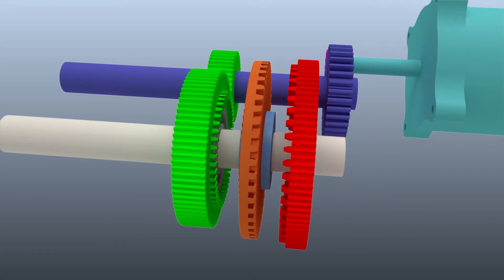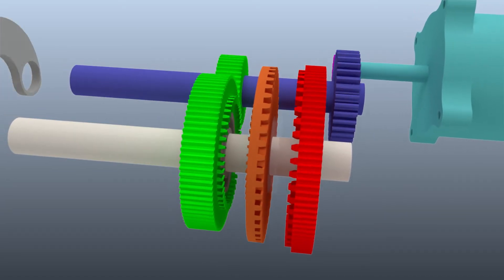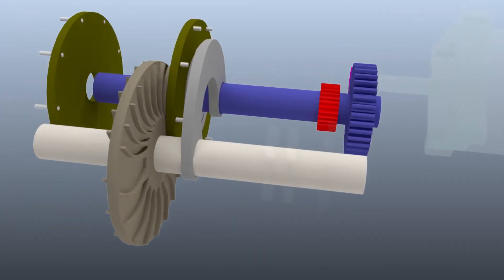The construction here is similar to the typical architecture of a double reduction two-speed transmission used in an electric automobile, except the synchronizer is replaced with a patent pending Geneva wheel mechanism with a custom slot wheel.